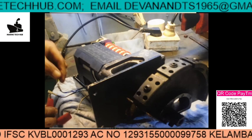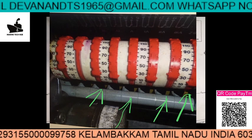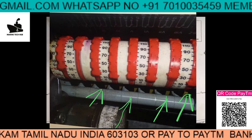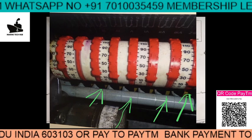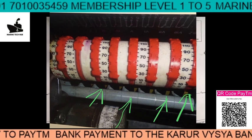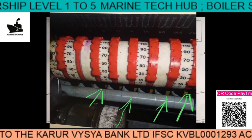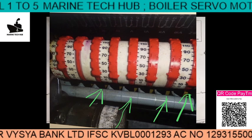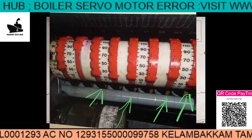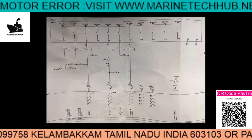You can see this cam here — these cams are there for different purposes. Each cam has a sequence of operation for the boiler, which you will know in detail when you are firing the boiler. Initially it will purge, then the damper will open slowly to full, then close. All these things you will know as an engineer. Make sure these cams are in position. I will show in a separate video in part 4 how to adjust these cams. If the cams are not in position, you will not be able to fire the boiler.